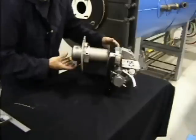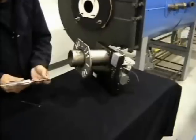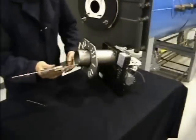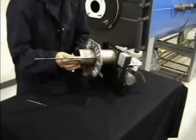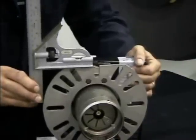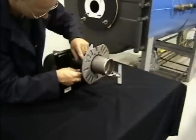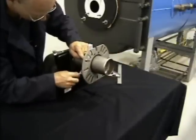You are now ready to set the insertion depth. Using an adjustable square, measure and adjust the flange position for the proper insertion depth. Check that the flange is level. Secure the flange on the air tube by evenly tightening the semi-flange side bolts with a 10-millimeter wrench.